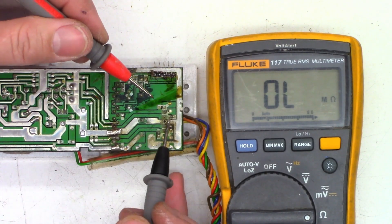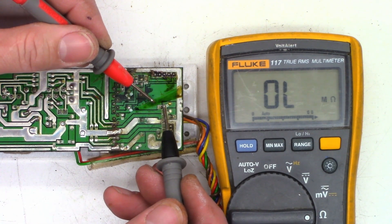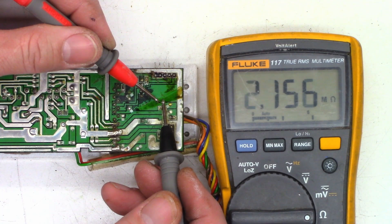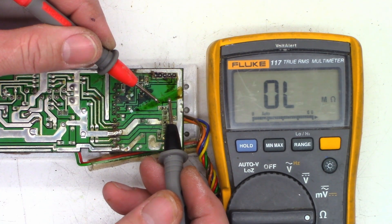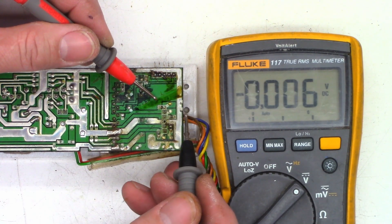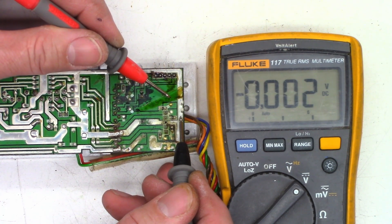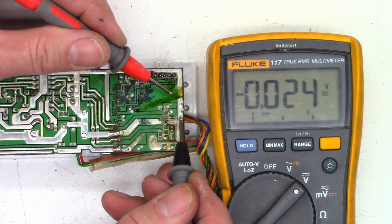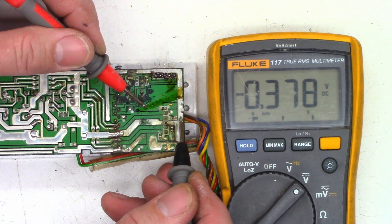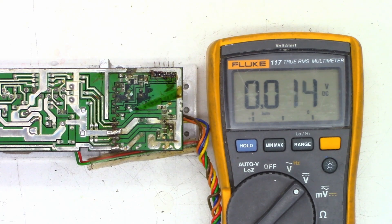Because the coating is still good here, I'm going to put my voltmeter in the goo. Let's put it right there and right there. And if we see anything at all — and we do — we see two megaohms. So this goo is actually conductive. I wonder if it has a voltage on it. Going from ground to the goo — I do see voltage. So this is actually capacitor electrolyte. There should be no voltage on this board whatsoever at this point. So yeah, it's going to need to be washed completely.